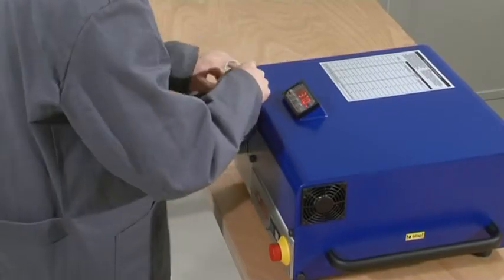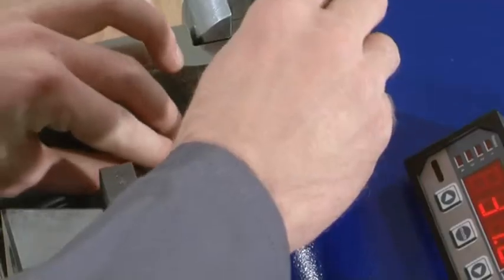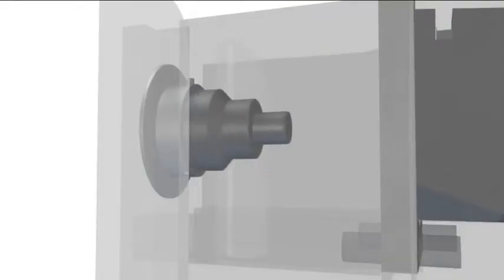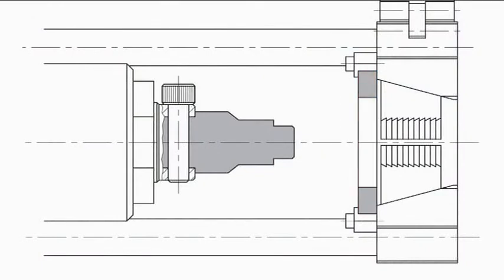Now the matched pre-assembly studs are inserted and fixed with the locking pin. The clamping jaw is inserted into the tapered mounting of the yoke plate. Make certain that the safety plate was inserted into the guide in order to avoid withdrawing the clamping jaw.